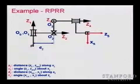Now, O4. So how do we define O4? It is along the common normal between, what did you say? Between? So when we define 3, we said it is the intersection of 3 with 4, right? For 4, it is 4 and 5. So because we define 5, we have the common normal between the two. How many common normals do you have? Infinite. So we have a choice. We can put O4 in different locations. We're going to select O4 there, and that will contribute, as we will see, to minimizing the number of parameters.